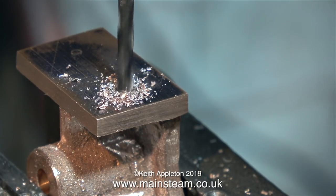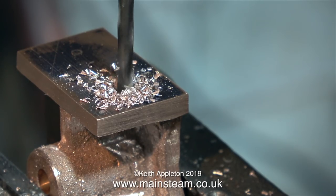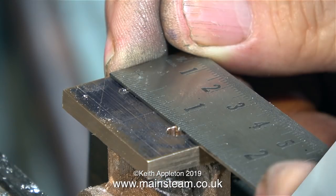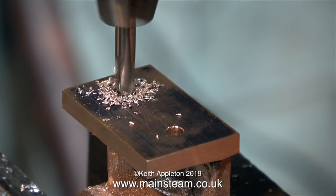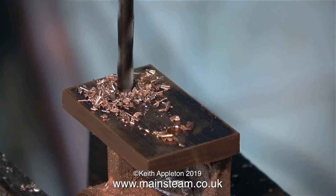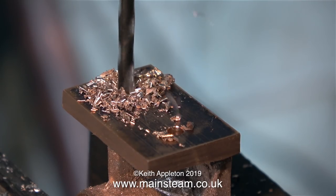As I've just mentioned, this is a 5/32-inch diameter twist drill, which is tapping size for 2BA. If you're watching carefully you will notice that the drill grabbed just as it was about to go through. A quick double check with the ruler for the positions of the holes, and once again centre drill first followed by twist drill gives me hole number two - or is it hole number four, because this is the second standard.